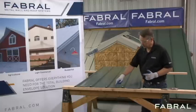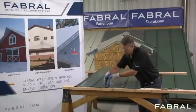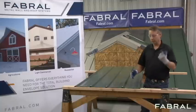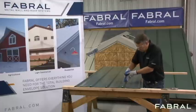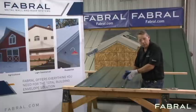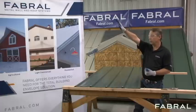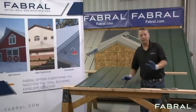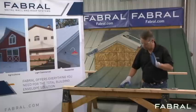For one reason, notice how the panel lifts up. When you put screws in the top, it puts pressure on the panel which causes the panel to have a little bow in it. Two, when you put the screw in the top, it's very hard not to over-drive that and squish the rib. Not only is it going to cause bellowing, but when you plane up the roof, you're going to see a little deformation at every fastener. It's very difficult to maintain the proper depth.